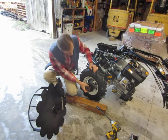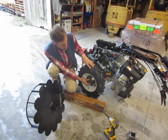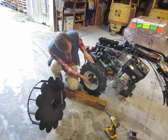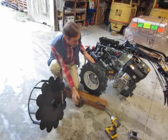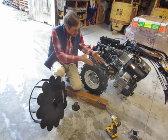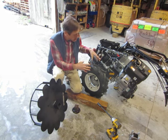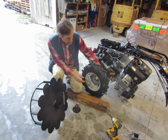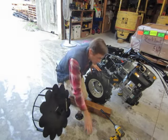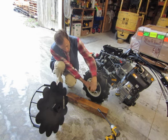On this set of wheels, this is an adjustable track wheel currently in its standard factory position with the adjustable rim piece on the inside — but it's way down in there, so it's just not going to work. We could adjust the rim so it moves further back in with the hub sticking further out, but on this 660 you actually can't, because it has a hub protector on the back and this is already the minimum wheel width position. So what I'm going to do is mount an axle extension on the inside that will push this out far enough to get it where it needs to be.